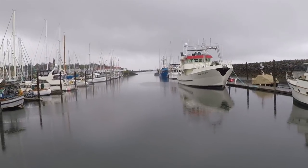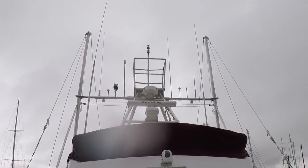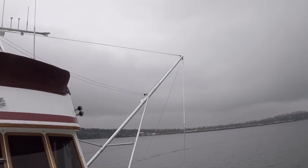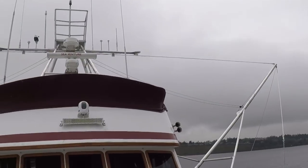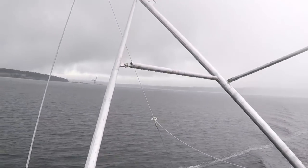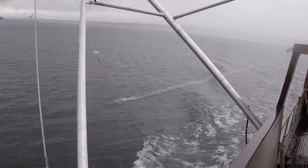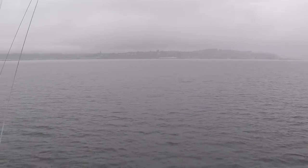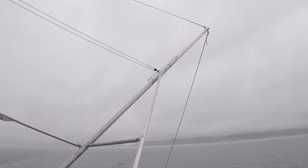It's a rainy day and we're leaving Port Townsend with the whole project complete! The poles are out for the first time — we just lowered them. We have a little bungee on the fish line that we loosen slightly to do the lowering, but it still holds it snug until we're ready to put the fish in the water. Here's our starboard fish in the water — first time, maiden voyage, sea trial, whatever you want to call it. The port side fish are staying pretty flat in the water, not spinning around, and the tops of the poles aren't doing anything crazy. All pretty steady.